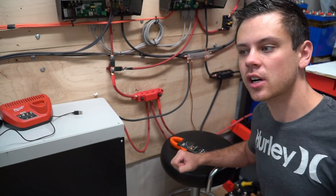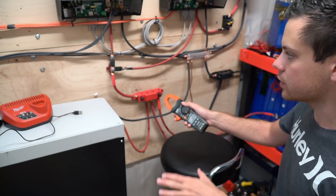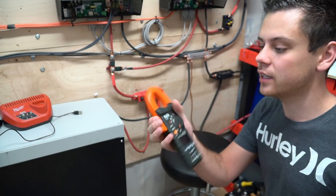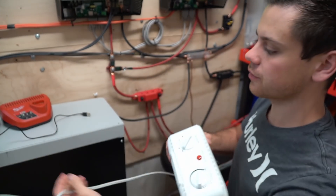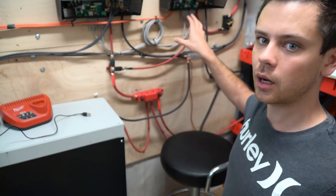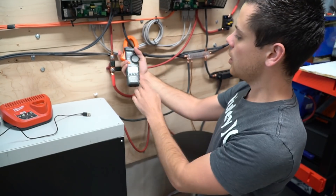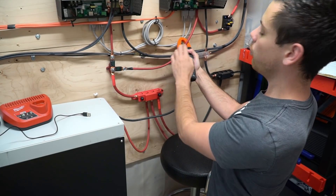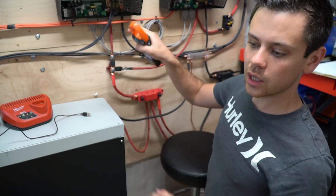Also, if you have high-resistance batteries such as old flooded lead acids, current sharing is a huge issue and you need to wire it perfectly. Now we're going to discuss current sharing for a large solar power system. You need a DC clamp meter and you need to start probing your system to see how the current is flowing — if there's a problem, you will instantly find it. First, we're adding a 1500 watt load to the inverters. These are in parallel operation, but one is powering the leg the heater is on. Comparing current: we've got 52-53 amps on one, and only 1 amp on the other. So even though they're wired similarly and in parallel, one is pulling a lot more current.